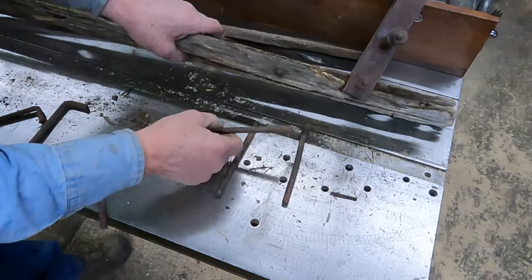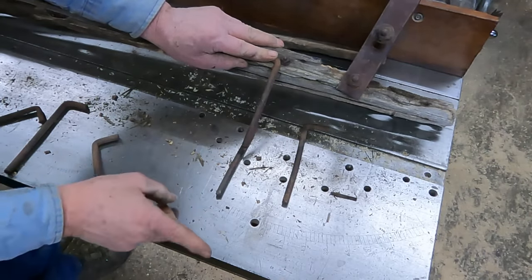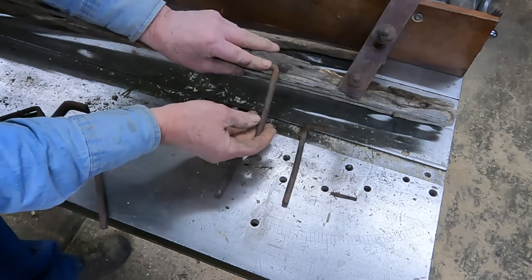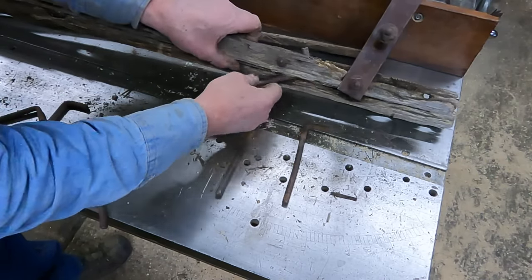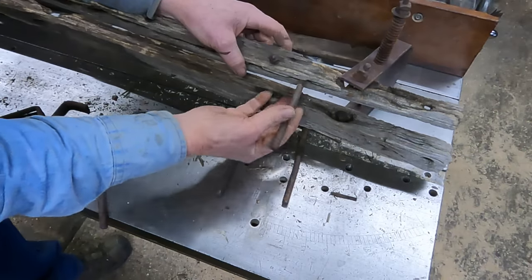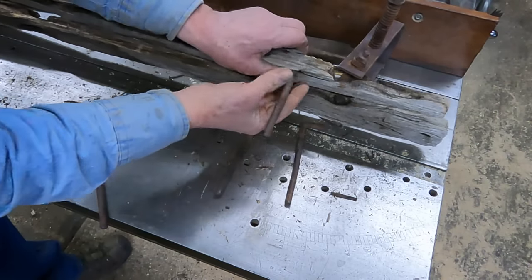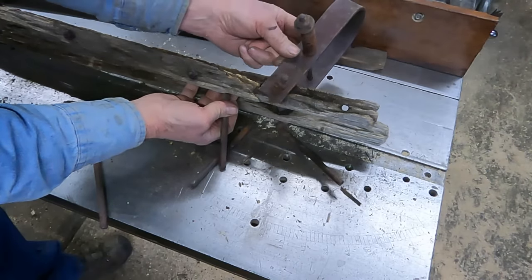Well, these spikes are above the spikes of the beater, and as the beater is thrashing this manure, these are also thrashing it on top, breaking it down as it is being spread. Well, as that force of the manure is hitting here, this is spring loaded through this whole assembly here.